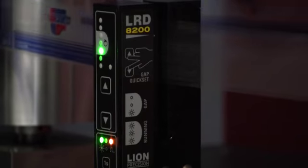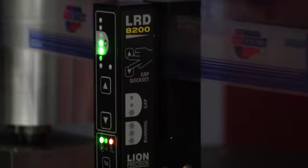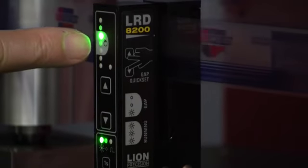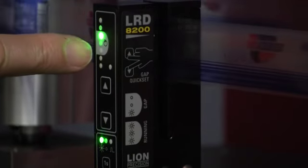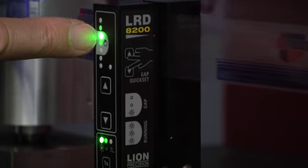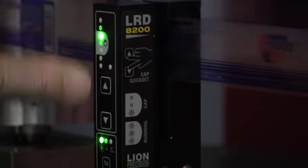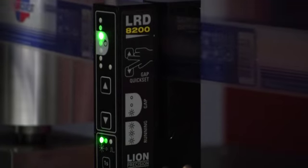The gray area indicates the lights that should be on when it's running. It goes to the bottom LED during the gaps and up to the top LED in the gray area during the labels. If it goes beyond the gray area that's fine, as long as it stays in that area while it's running — the sensor is working correctly.